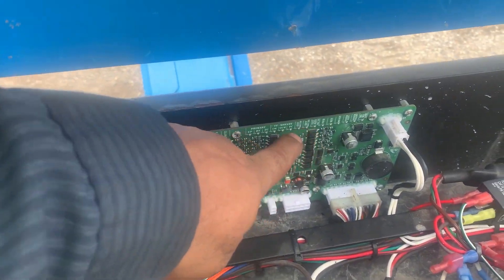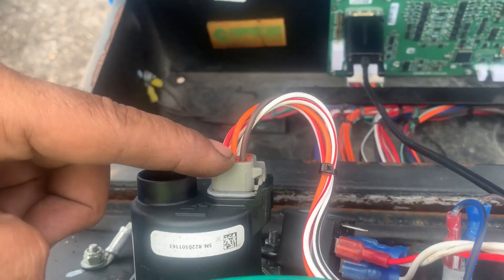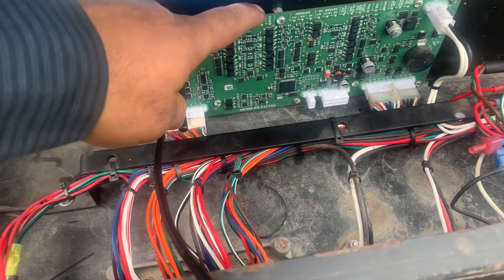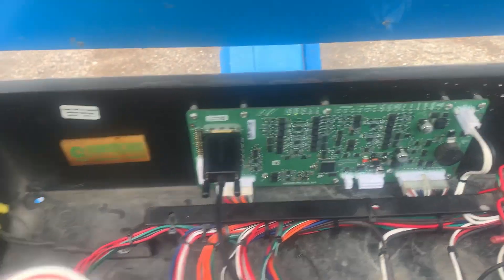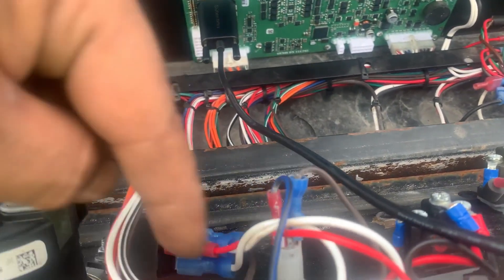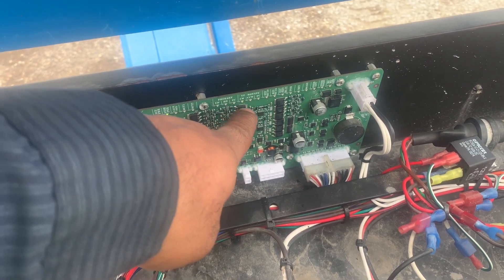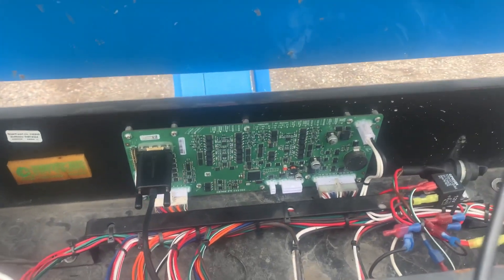But if you don't get the lights and nothing turns on here, you need to check the joystick first, then go through the connections and wires to the board. If the wires are fine, then you might have to replace the board. So if you have an output here and the voltage is right, verify the wires to the board. If you don't have any output or the LEDs don't turn on for each function, you need to replace the board. That's it for today, thank you.